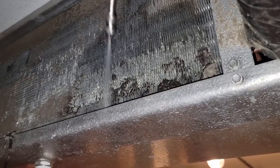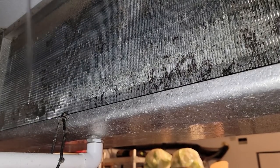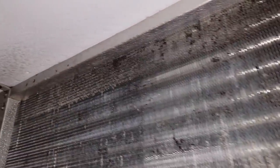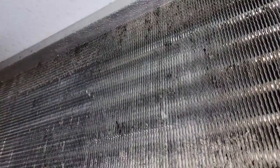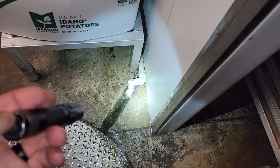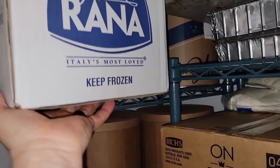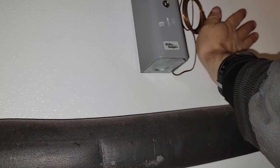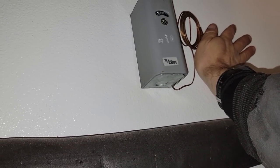You can literally see through the coil now — you couldn't see that before. Since I had to get this out anyway, I might as well go down here and wash out the evaporator too. I really should scrape this off ahead of time but I don't have my brush in here. I think I'm just going to go ahead and see if I can get that crud off like that. I'm going to make sure we rinse that cleaner out really good. She looks a whole lot better than what it did. You can see all the crud coming out of the drain, so we're definitely getting it out of there. Let's get to this freezer — I just heard it kick on. We'll go out and see how that sight glass looks.